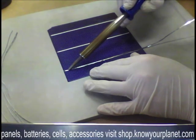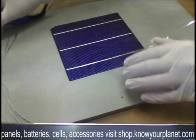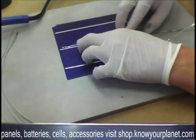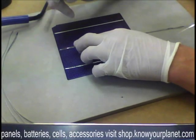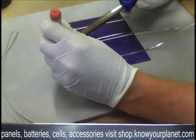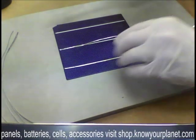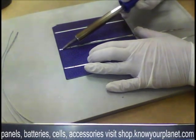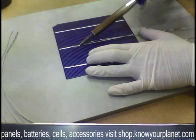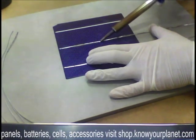Just run this mostly over the end. As usual for the demonstration I'm using the Antex HP 80 that we also sell. It's a reasonably cheap soldering iron but it benefits from a large tip which acts effectively as a large heat sink, and that large heat sink means I'm able to get a continuous amount of power put down while the soldering iron regulates its own flow of power.